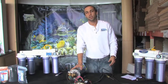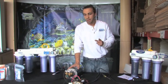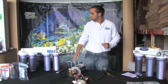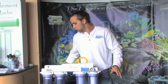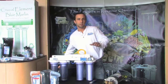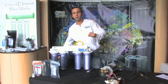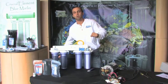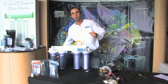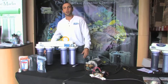You can hear my production water entering my barrel, you can hear the pump, and you can see that we're sitting right about 80 psi strictly through adjustment of the flathead screwdriver on the head of the pump. You'll notice that your production has gone way up, that your TDS out of your membrane is lower, and that the system is now automated — which I'm going to demonstrate. I'm going to simulate a full storage container by holding up on the float valve. Notice the unit has shut itself off; the back pressure has found its way to the high pressure switch. The check valve has prevented that pressure from bleeding backwards, and the unit will stay shut off until you drop the float. The unit kicks back on, the pump finds itself, and we're making water again.